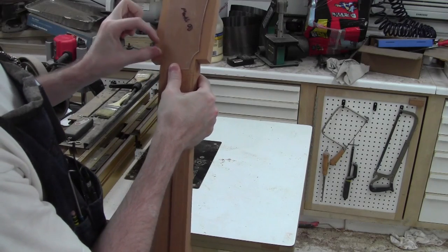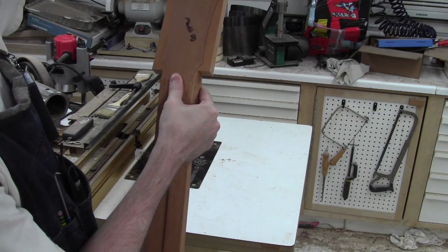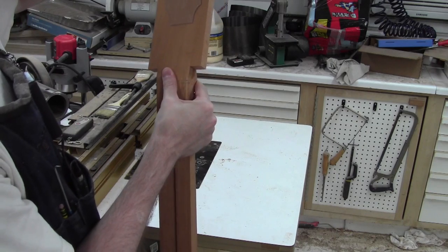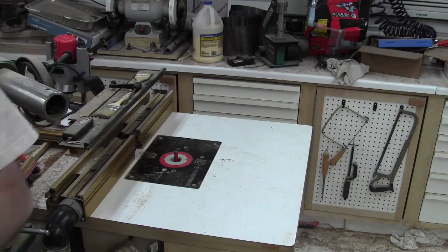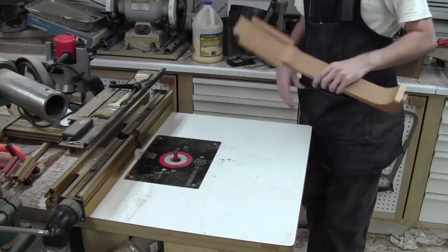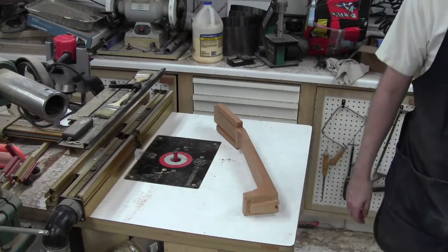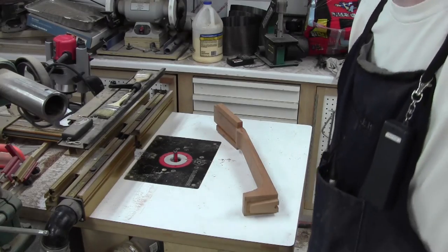So those wings will only see a little bit up here, a little bit down here, a little bit out here, and a little down here. It's almost exactly this width in the middle. We take about a 16th on either side, so I don't have a ton of concern for tear out, but I have a little. So I'm going to grab some hearing protection, some other personal protection devices, and we're going to give flush trimming this a shot. We'll see what happens.